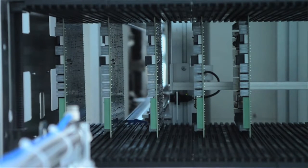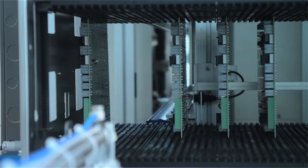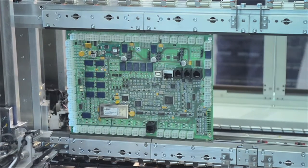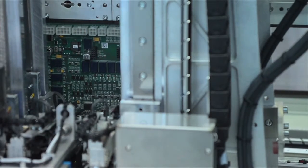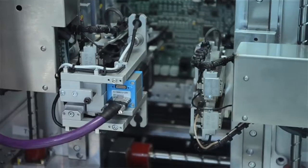It will load in the boards on second or third shift or on first shift, automatically select the program and test all those boards in the first magazine. It can continue out in pass-through format or go back into the same magazine, and then when that magazine is fully tested, another magazine would be installed and boards would go in automatically. This system can test in batch mode or even in a SMEMA line, horizontal, where Seica Automation, our sister division, builds and designs loaders, lifters, and other equipment, and in the pass-through mode can take boards in horizontal and flip them 90, so you don't need any magazines.